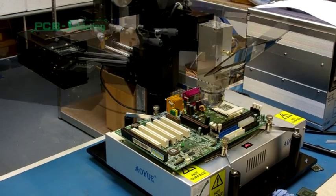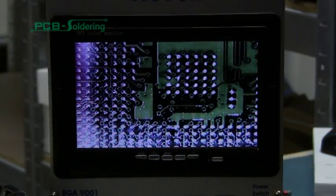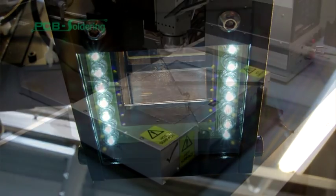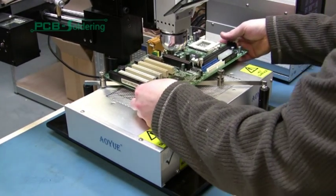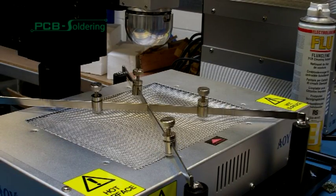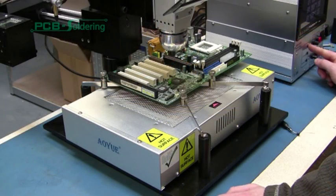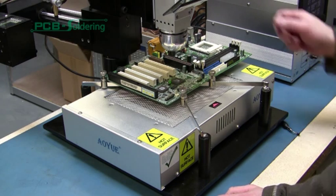Below this is the vision tray, which houses the visual inspection unit. This allows the user to view the bottom part of the component, projected over the top of a circuit board for correct alignment, using two adjustable light sources contained within the tray. On the base of the unit is the pre-heater, along with the PCB holders and four holding screws that can accommodate boards up to 280 by 430 millimetres. Larger boards can be accommodated by removing the holding screws. The pre-heater unit provides heat to the printed circuit boards and attached components prior to rework, supplying approximately 75% of heat energy during the entire rework process.